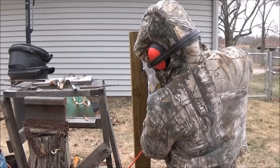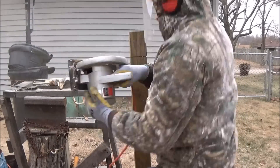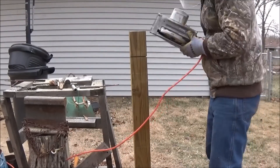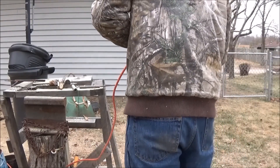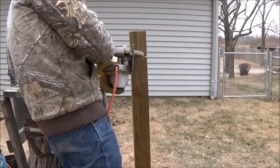What I'm doing now is measuring where I need the pivot point or the fulcrum to be on the seesaw, so that the hammerhead will contact the anvil when it's fairly flat. Basically, we don't want it hitting the anvil at an angle.